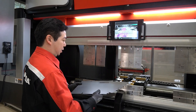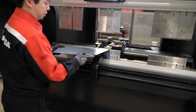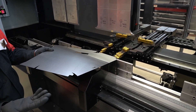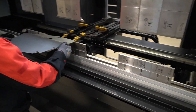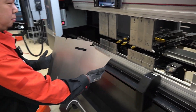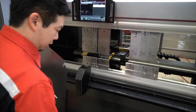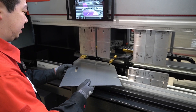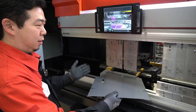I'll be bending this part using these two back gauges as my normal back gauge, and I can use this right-side gauge as my side stop as well, so every single time I'm bending a part I will have a zero-zero position. I'll start and — there you go — the panel moved, everything came over including the foot pedal and the HMI monitor. Because I also have the side stop, I know I'm gauging exactly there, which is especially nice when you already have a side finish — you don't have to guess where to put the part.